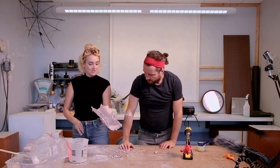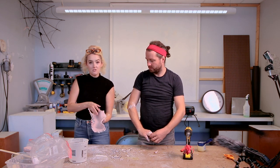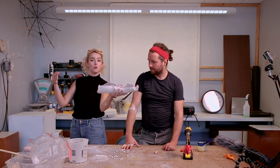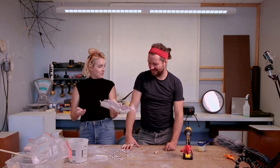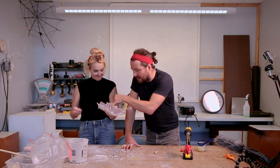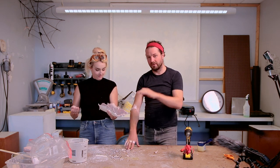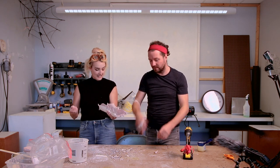And as you can see, it just sits lightly in here, so you could very easily paint some plaster into the material and get about a half to three quarters of a human arm, which if you're doing a relief sculpture, might be exactly what you needed. And this process, I think, ended up with fewer bubbles. It's easier to get the bubbles out when you're doing the layup process than the submerging process, because it's going on in that thin layer, it has that chance for the bubbles to escape, and you're working that surface.